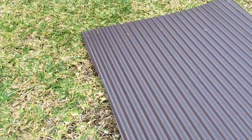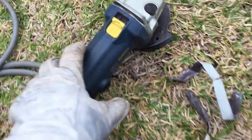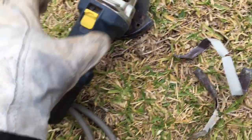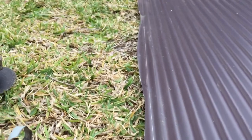I'm halfway through cutting a length of steel here, so I thought I'd put a really quick video up on how to cut a straight edge when you're cutting steel. I've got a cut-off blade on a grinder — a death wheel. Because it's so small, there's no way you're going to get that to cut straight. See how it waves in and out if you look along the line.